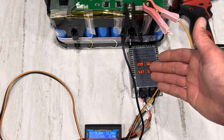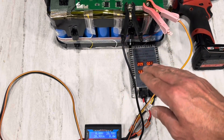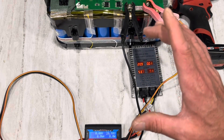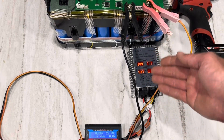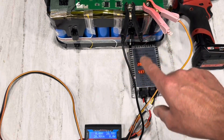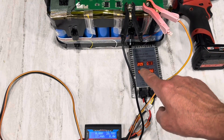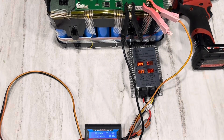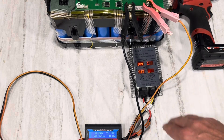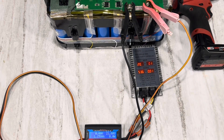This is a great addition to your off-grid or battery-charging arsenal. The little brick aluminum ones start around $20, this mid-range unit with a display is around $50, and the big digital ones are almost $200 without putting out any more charge. Using a nominal 12-volt panel to charge a 51.2-volt lithium iron phosphate pack is remarkable. Just remember: whatever your panel voltage is, your battery needs to be 10% higher for this boost converter to work. I've been testing it for a few weeks and it's worked fantastically. Please hit that like button, subscribe, and leave any questions in the comments. Thanks for watching the Off-Grid Mountain Homestead!